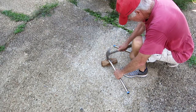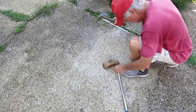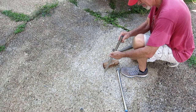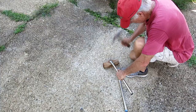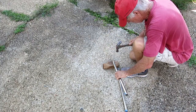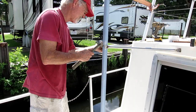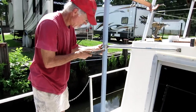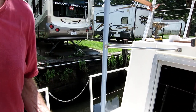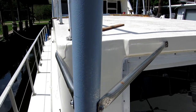This is a little crude, but I was using the head of a maul and a hammer to flatten the ends where I could drill them and bend the ends to make the right angle. By the time I flattened them, drilled them, put the flap wheel on them and cleaned them up, they look pretty good. You have to be careful to get the seam in the middle — these are not seamless tubes, they're seamed — because if you try to bend them with the seam toward the edge they'll split. With the maul as a backup I'm able to make these little curves fit the aluminum pipe pretty well and got them really smooth.